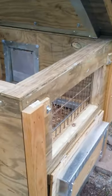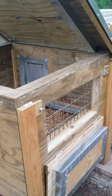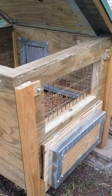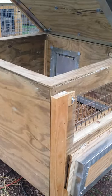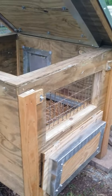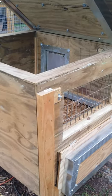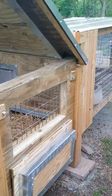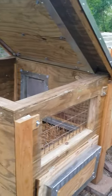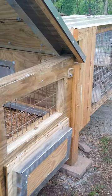I hope this has been beneficial. We're very happy with the result — these boxes are extremely warm with all the insulation. If you go any tighter with the doors or other seals you'll probably run into issues with excess humidity and condensation. So this is a balance of airflow and minimizing heat dissipation through the walls that works for us — little or no condensation and good warmth even in the coldest weather. If there are any questions, most of you know how to get in touch with me; drop me a text, email, or Facebook message and I'll do my best to help keep you on track with your construction.